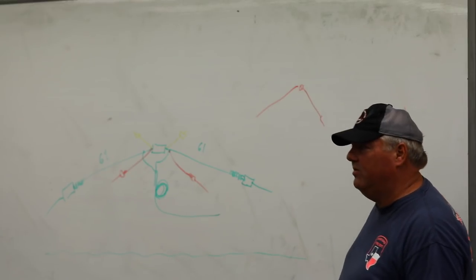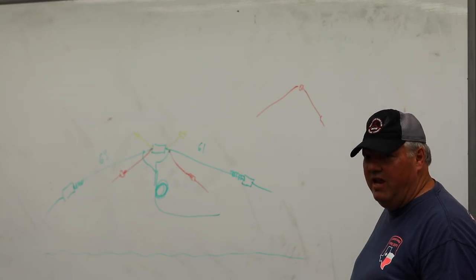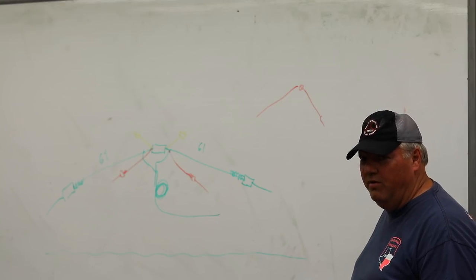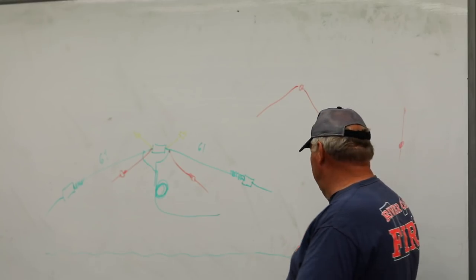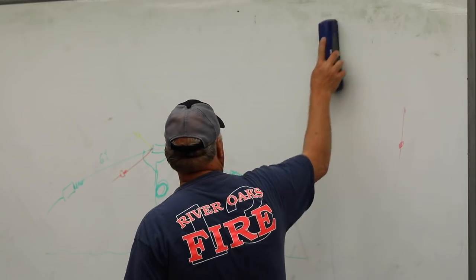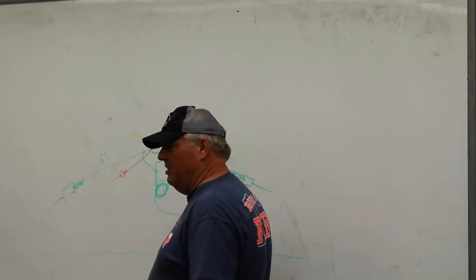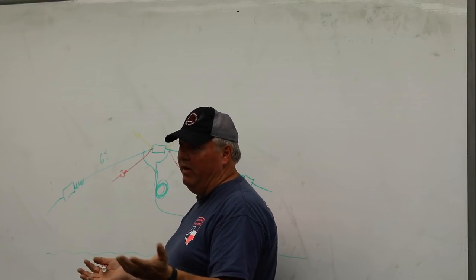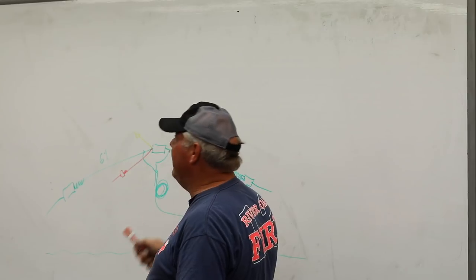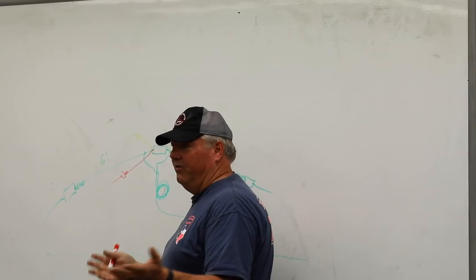And when the radio gods say it's okay for us to talk, he is 10 over at my house, and I'm 10, 15 over at his house. I always have to be one more to come down. But we talk, and it's the wrong direction. So the answer is yes, they are directional. Does that mean you're never going to hear somebody from the other direction? No. It just means if you had your antenna system built in the oriented way, you could probably hear them better. That's why we make beams. But the wire antennas, mine is just stuck up there however I could get it. Because let's face it, with some of our properties, it is what it is.